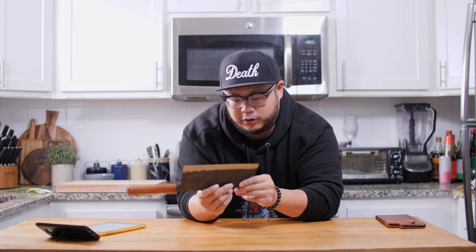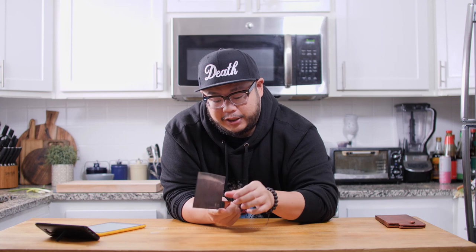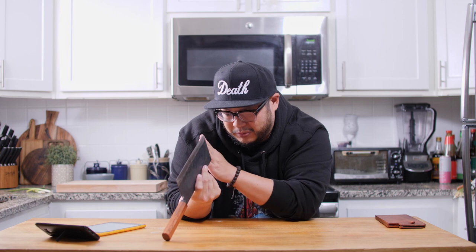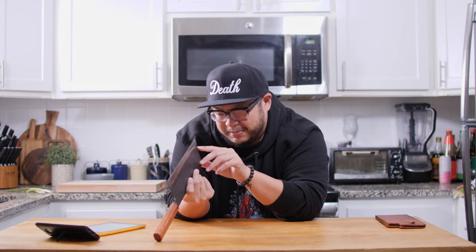The only feedback I have on the grind is that there is still some work to do, especially towards the front end. The choil always looks decent — if you look down the choil on these new grinds, they look fantastic. But when you look down at the tip end, that's where you notice some inconsistency. The right side of the knife is a full flat grind, nice and gradual, but on the left side there's some extra material and it is a lot more convex. So there is some unevenness towards the tip of the knife.